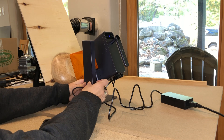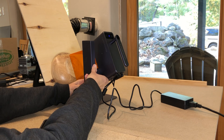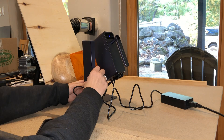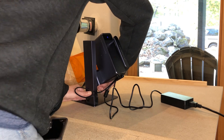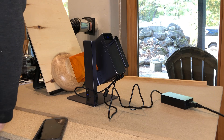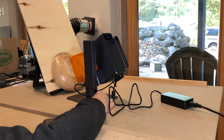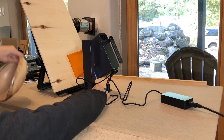The shroud comes on and off really easily, and in this case I'm going to leave it on and use it to set the focal distance of the laser. That's a really nice feature of this unit as well. You can either just use the orange shroud as your distance guide, there's also a little foot that flips down, or you can just use a ruler if you take the shroud off.